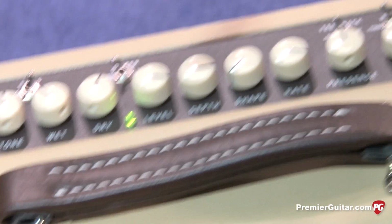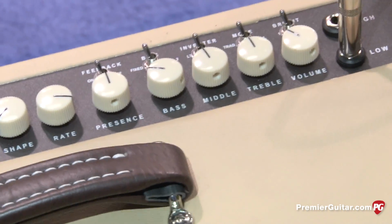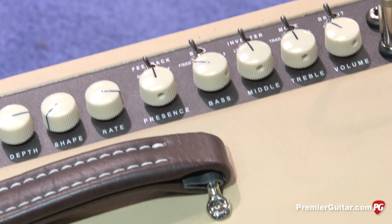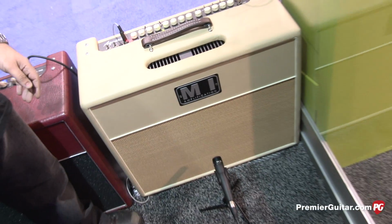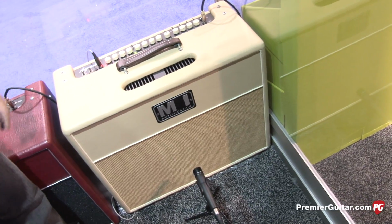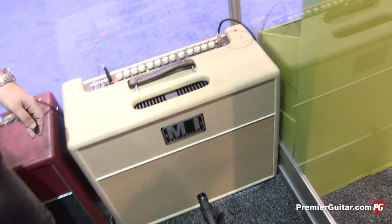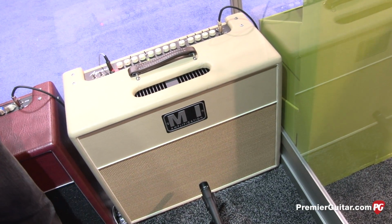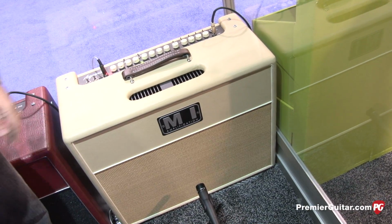We've also got a couple of different preamp modes to bump up the gain. Another interesting thing with this amplifier is you've actually got 2 phase inverters in there. So you've got a blackface era long tail pair, and you've also got a tweed era cathodyne, which is a bit dirtier, bit bigger sounding. So you can adjust all that from the amplifier. So it's quite flexible, anywhere from 30 watts down to about 5 watts, depending on which power amp mode you choose. You can run it fixed biased or cathode biased. So that's this amp.